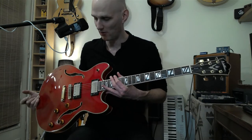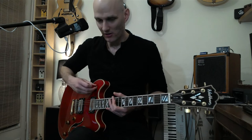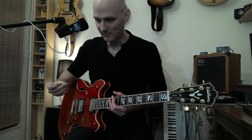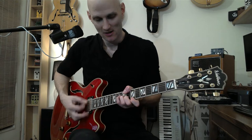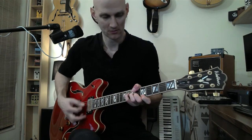So what you heard there was the vintage 50s wiring. I am now going to change the potentiometers to linear pots, just to hear what the difference is. I'm going to do a couple of sound takes. Okay, so I've changed the volume pots out to linear pots, so the B500K. And the taper is a lot smoother. Let me put it on with some overdrive.